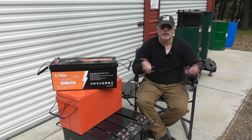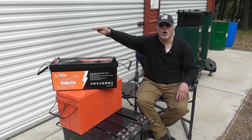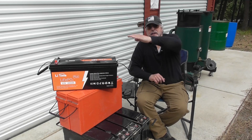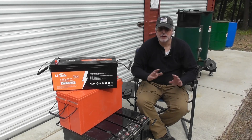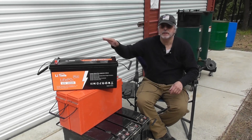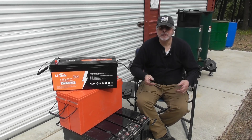Once you're done with the microwave or water pump, the power comes back on — it's a bit frustrating but manageable. The biggest difference with lithium is that the voltage stays the same all the way through until the battery is empty. You can't monitor just voltage because it'll show 52 or 54 volts right to the very end, and then it's completely empty — no reserve power left. I ran tests at the cabin to see what happens when it runs all the way out.